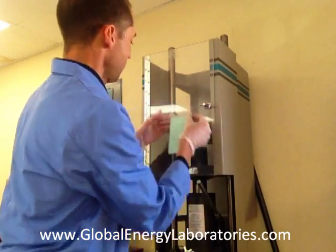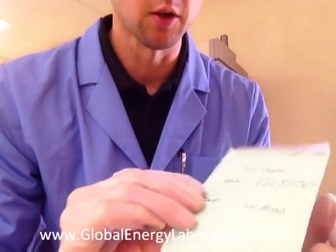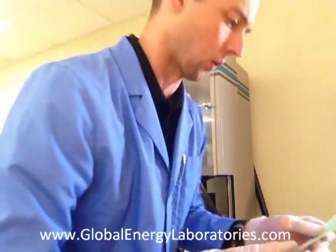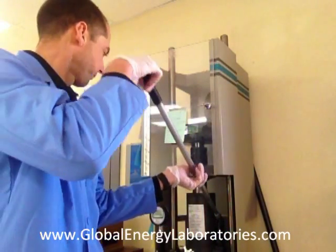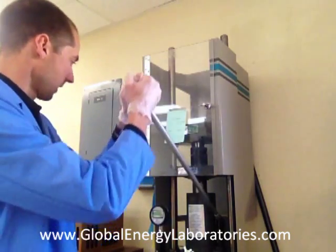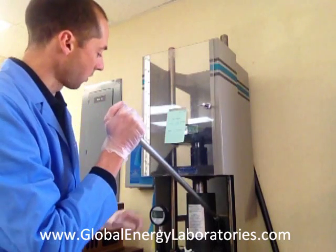The crush test: we ramp up at 2,000 PSI per minute and do a two-minute hold at the target stress. In this case we're going up to 4,000 PSI — what we call a 4K. In pounds force, we're going up to 12,570 pounds; don't exceed 12,800 pounds. So: ramp at 2,000 PSI per minute, hold for two minutes at the 4,000 PSI level, raising the cylinder and increasing pressure by jacking it over time and reading out in pounds force on the gauge.